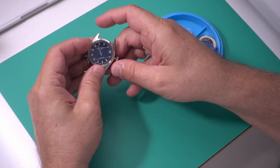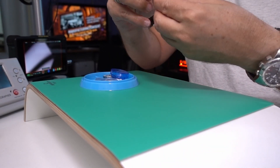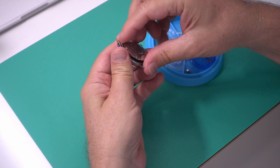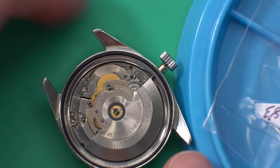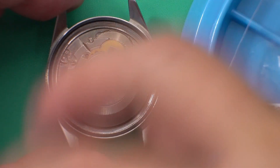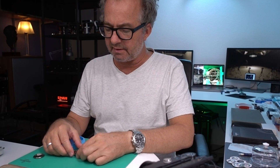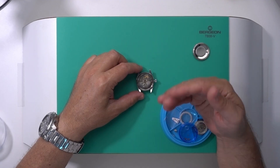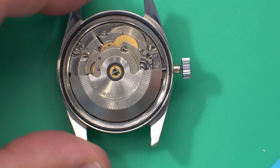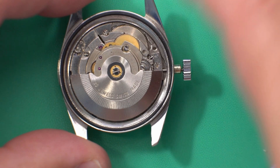What's interesting about this is the dial is wrong for the movement I want to put in it. One thing that's interesting: it's a 32 millimeter case with no special movement ring inside. So it fits the standard diameter movements - whatever the standard size of ETA 2472 and 2783 is. That's a very standard diameter, and this case is made for that.